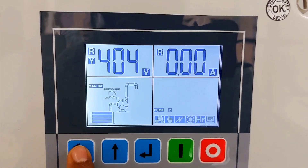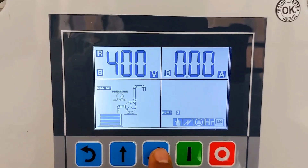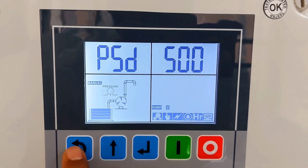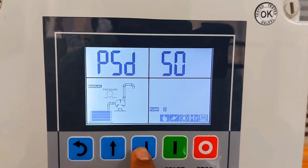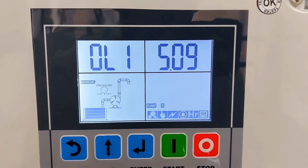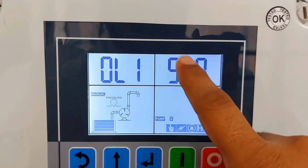Now let's go into the menu to set the pump parameters. Press the menu key once so the first symbol blinks, then press enter. The password is 505 — set 5, use the menu key to change cursor position, then set the last digit to 5 as well. Here you can set pump one over current. First measure your pump current during normal running condition, then add 25% to that value and set it as the over current threshold.